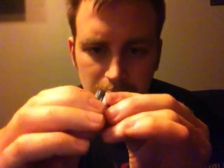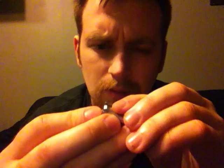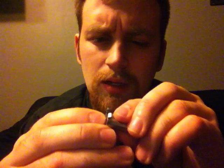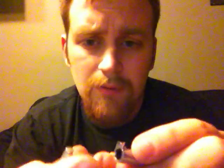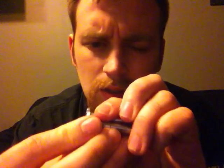Now I would say, looking at mine side by side, I've probably got 3/1000ths of an inch shaved off of mine, and the pitch is actually, it's not much, but it's just a hair flatter. So if your angle is like this, mine is just a little bit slighter than what it comes with.